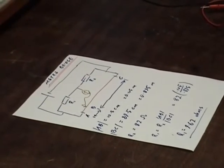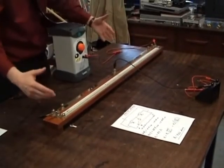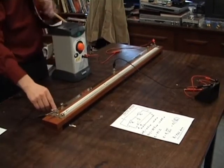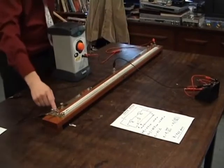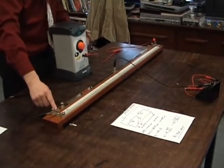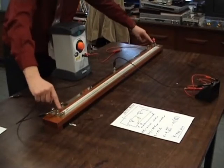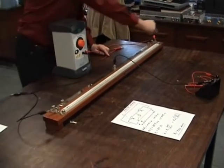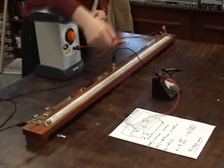So here are my two resistors — one small one there, one small one there. I'm going to pretend that I know the resistance of one of them, this one here, and I don't know the resistance of this one. In fact, I've measured this before — it's 82 ohms. So I know the resistance of that, and let's say I don't know the resistance of this one here. This is my two resistors, this is my power supply coming in here, the current can go up here and across, or it can go down and across, and what I'm going to do is put up my galvanometer.